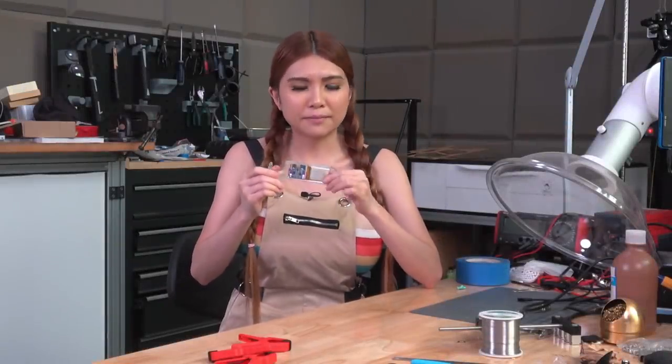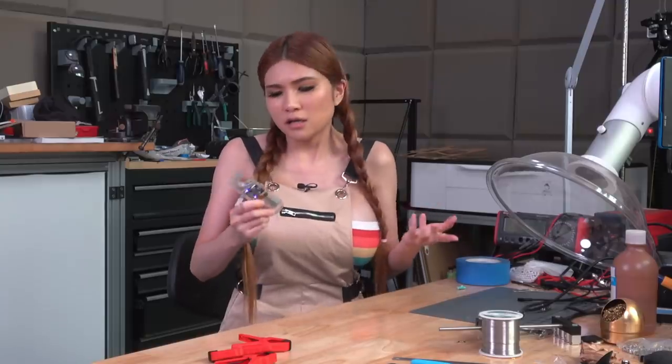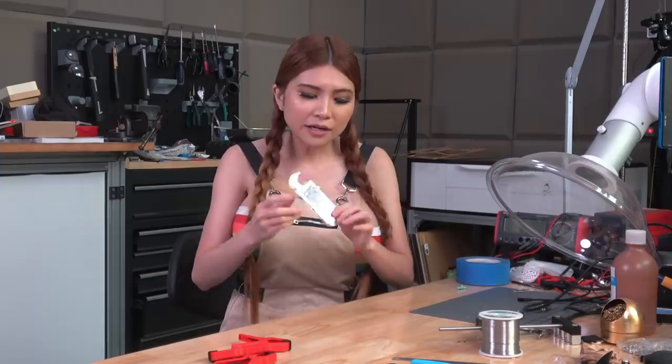I think induction charging would be a bit better than the magnet, but the magnet was easy for a prototype. Once the UV LEDs drop in price, we'd really have to test with bacterial swabs to see just how well it works. Still, as a base concept, UV light inside clear plastic dropped in your bag or pockets or even your drink to cut down on viral load. Maybe there's something there? Let me know what you think in the comments.